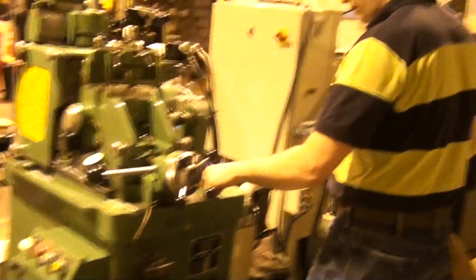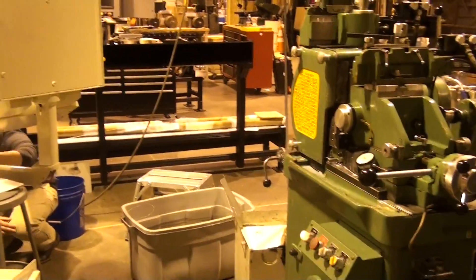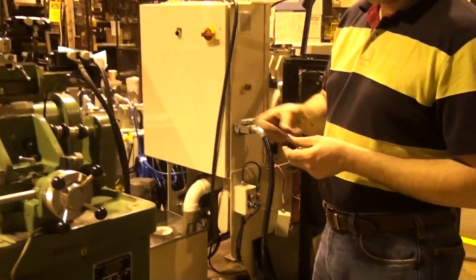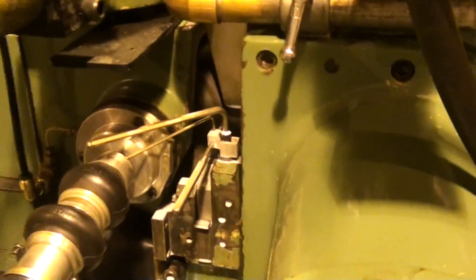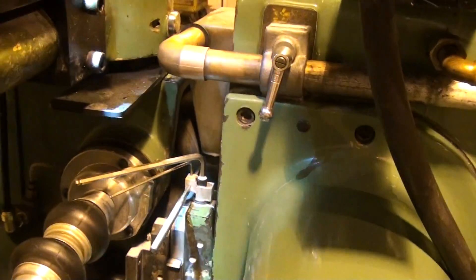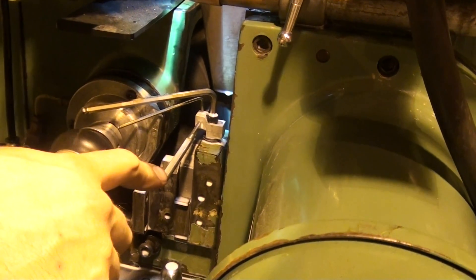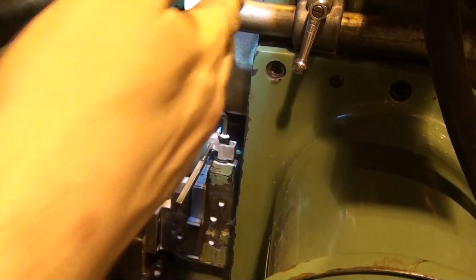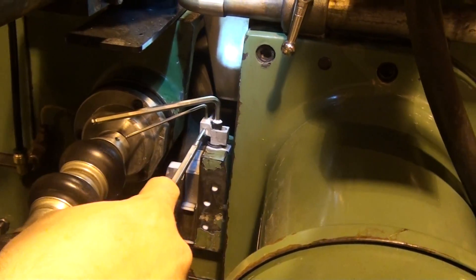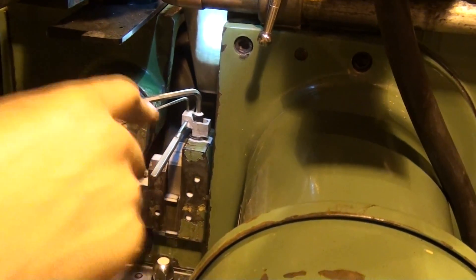We cut down your parts to make them easier to handle, but you'll need to put some kind of piece of wood on that side. To set your grind length of three and a half inches, we came up with a little stop. You'll also make a stop that's smaller than your part diameter to ensure it can get between the wheels without being pinched or ground. Adjust height by adding or removing washers, and adjust depth by loosening the set screw and moving the stop in and out.